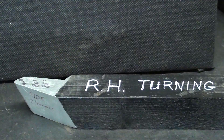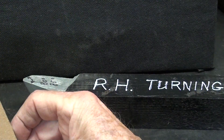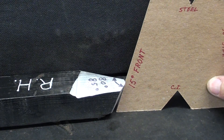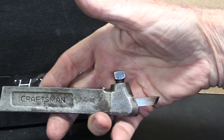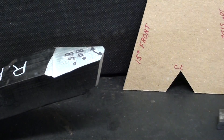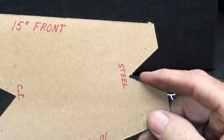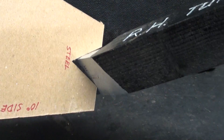Using the gauge on our right-hand turning tool — for the side, which is ten degrees — you can see I'm right at about exactly ten. Now let's take a look at the front angle; it calls for about fifteen degrees. You can see I'm not exactly at fifteen degrees, but remember that if you're using this type of tool holder, it holds the tool at an angle as well. So the tool would be held up approximately like that, and then you would be pretty close to the fifteen degree front angle. And then finally for steel — and they do not even specify the angle here — but this is the angle of keenness. I'm not right on, but it's pretty close.